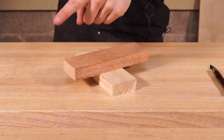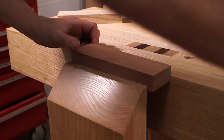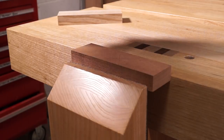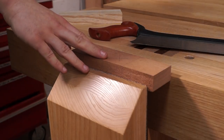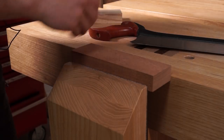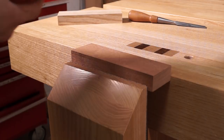So, to the vise. We're going to remove it from this one first, so get that in there nice and even, and we're going to get our crosscut saw and work as close to these lines as possible. I've said it in a previous video, what some people will do at this point is get themselves a chisel and chisel diagonally into that line from the waste side, and then that will give them a V-groove that they can then put their saw into and go down to that baseline.